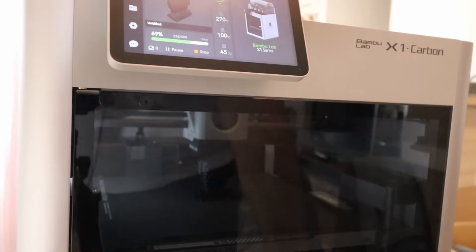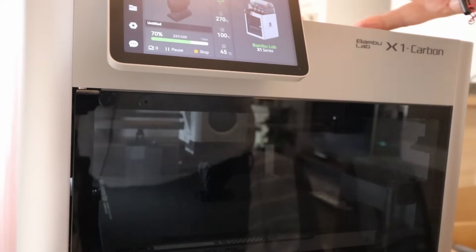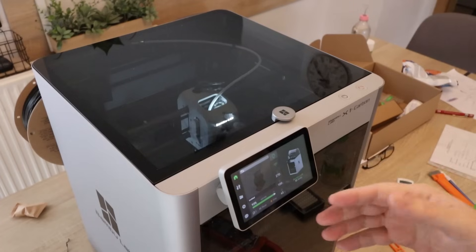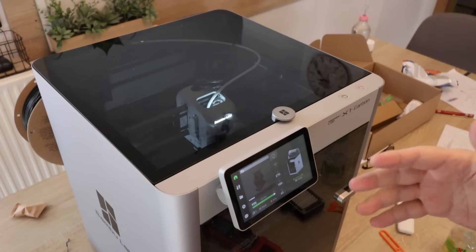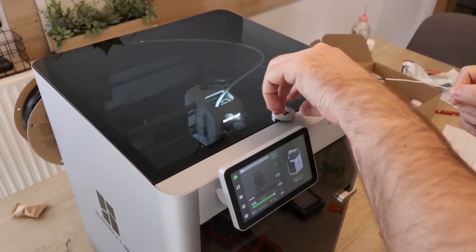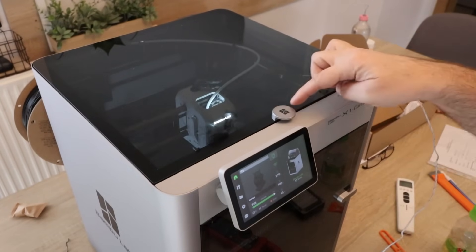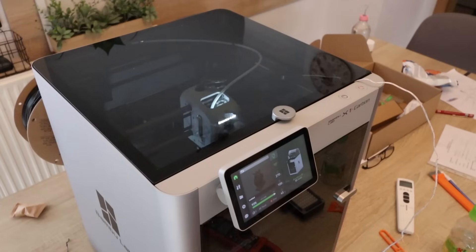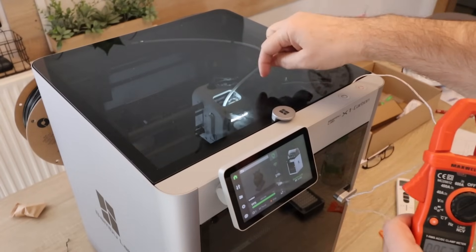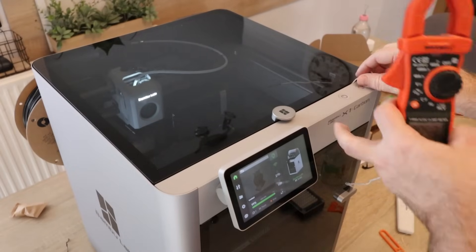At the end of the printing I'll try to measure the temperature inside the enclosure, but it's a little hard to find a gap because of the sealing line. Three more minutes of printing, and this is suspicious — it still says 45 degrees Celsius. I'm not sure if it controls somehow — can I set bigger values in the slicer or something? Unfortunately I have to open the door. Now there is a small gap but I have no choice. 53 degrees Celsius at this position — I think the sensor almost touched the glass. And now it jumped to 47 degrees Celsius according to the screen.